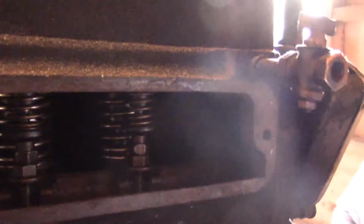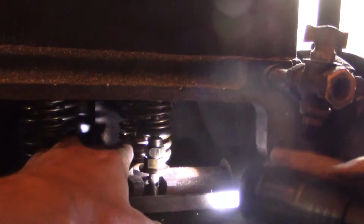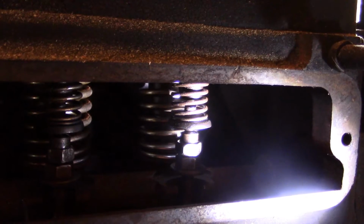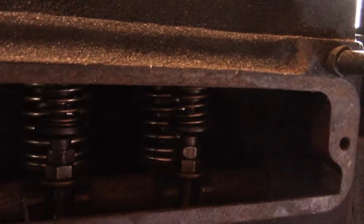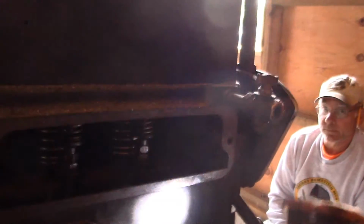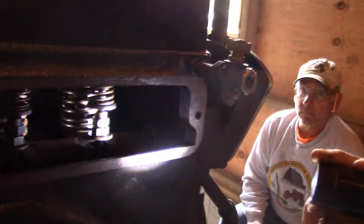But, all right, now the back ones, as far as all of them, they all work the same. The back one is your charge pump. You're talking about the big one with the spring here? Yes. That's your actual fuel pump that delivers your fuel. It is timed, it delivers a full shot every time, whether you need it or not. It's a full stroke pump for the full shot you will ever need on all 4. So fixed displacement. Yes, right.